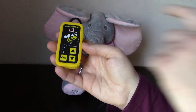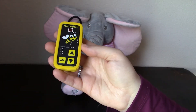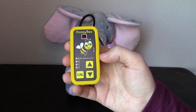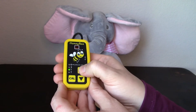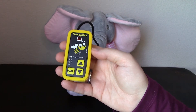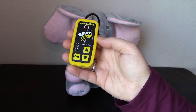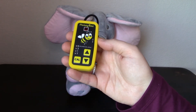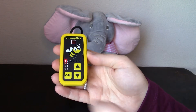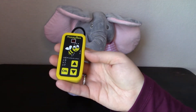For example, you could start at the 6-inch range of movement and then move them all the way towards touch, so they have to move more in order to activate the switch. Each range can be selected by using the up and down arrows here. Keep in mind that every time you turn on the switch or change the range, the switch automatically calibrates. However, due to changes in light and temperature over time, you might see effects on the sensitivity. To recalibrate manually, you would just press this Cal button here, making sure you keep the area in front of the sensor box clear.